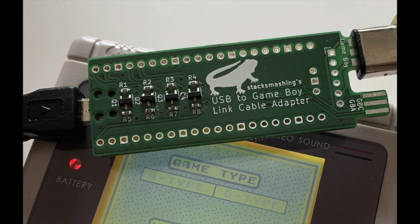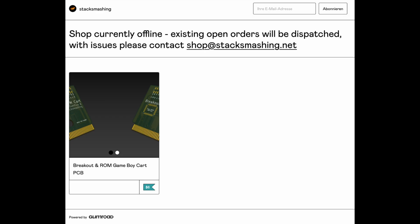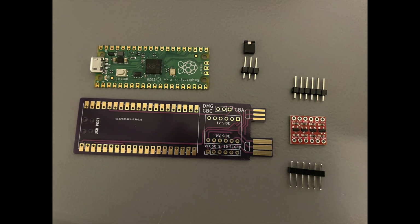So if you think of following along, unfortunately, buying these is as much of a myth as iPhone kernel debugging. However, there are alternatives. Basically, you really just need a level shifter to shift 5V to 3.3V, and that's really what there is to it.